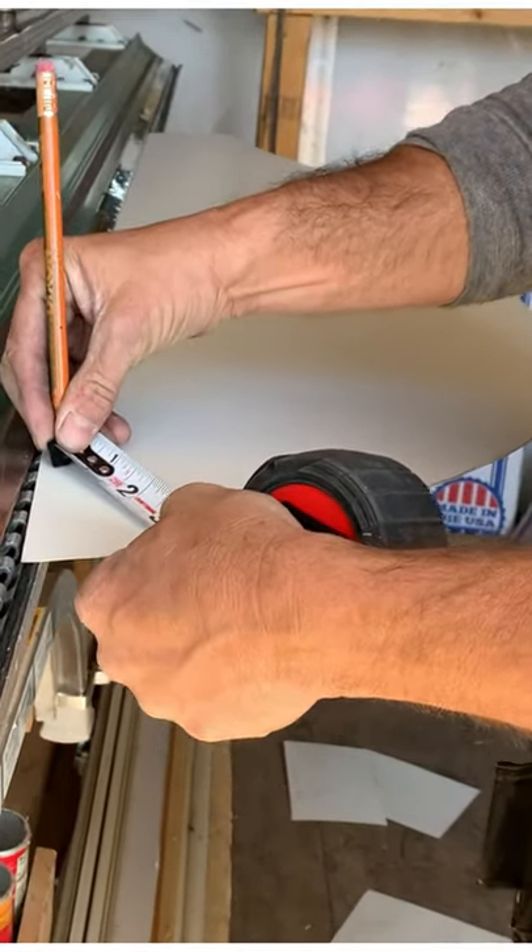When you're cutting the arch line, cut it easy — because the harder you cut it and the longer the strokes, the more this will curve around. You'll see me wanting to straighten it out. I lay it down on my table; I want it to naturally lay flat. And I will gently assist it until it mostly wants to lay flat on its own.